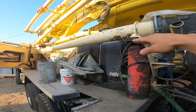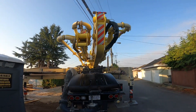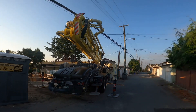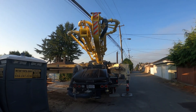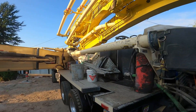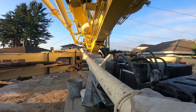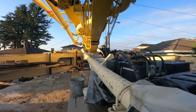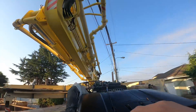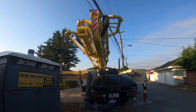They also adjusted it down at the back, so you can see how much lower that deck pipe sits now. When I lift this boom out of the cradle, you can see how close we get to the supply wire — remember the rule is no touch; that's cable and telephone service. As we swing over, you're going to see how close this boom gets to the deck pipe. We'll eventually have to come up to clear the slewing cylinder for the rear outrigger leg, but as you can see, that allowed me to sneak underneath those supply wires.